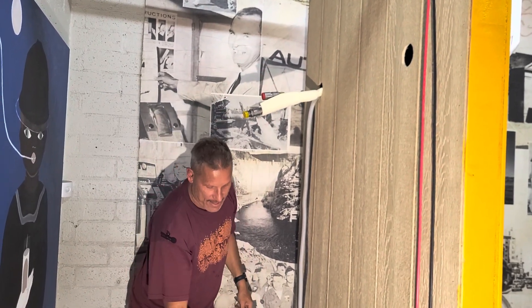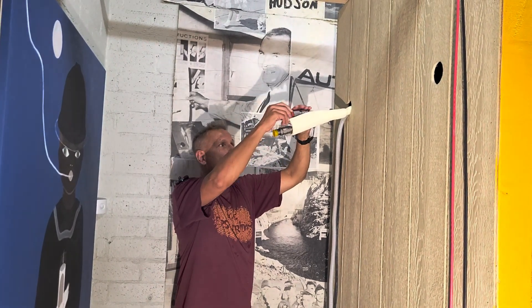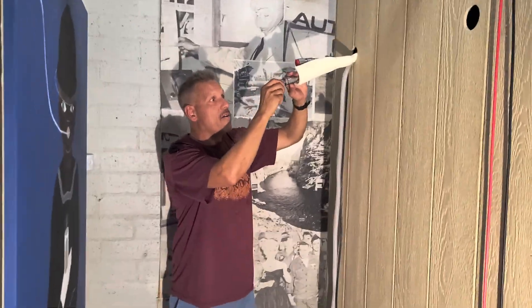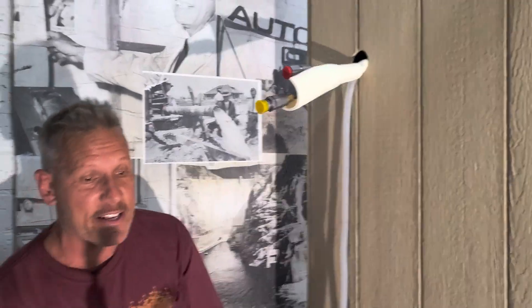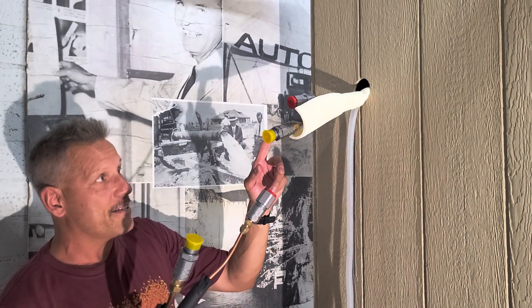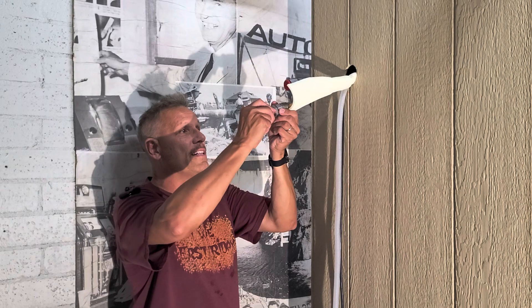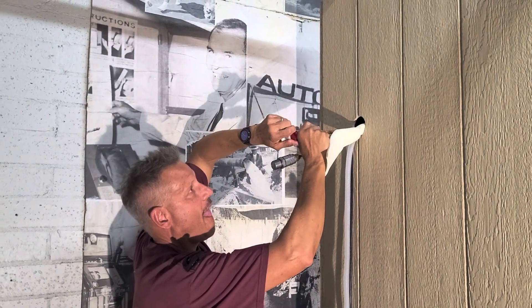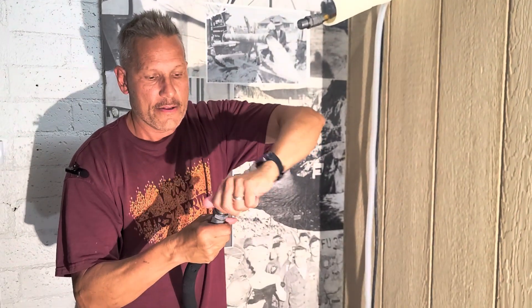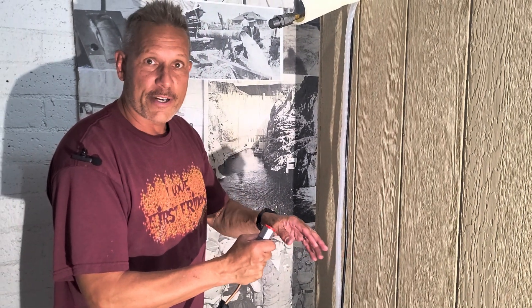The stubs of the indoor unit refrigerant lines are free. You have to remove these two caps — there's a red and a yellow. The outdoor unit also has a red and yellow, and you won't need to know this because there's only one way it's going to work, but the red from this one goes on the yellow from this one and vice versa. It's very foolproof — they only screw in one way. The yellow ones just pull off; the red ones twist off. It's important to keep these on up to this stage because you don't want to get dust, dirt, or other debris in these before you're ready to do this step.